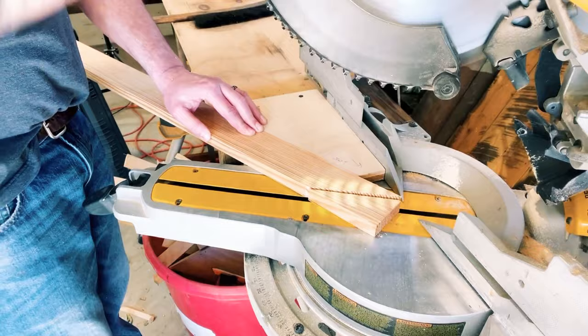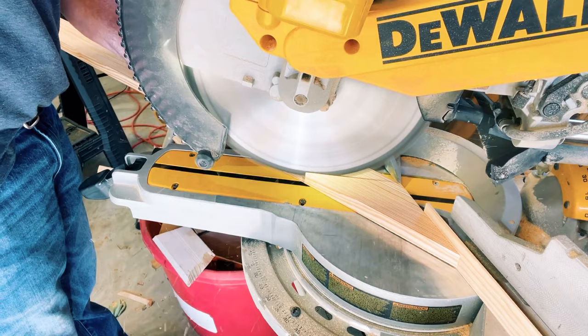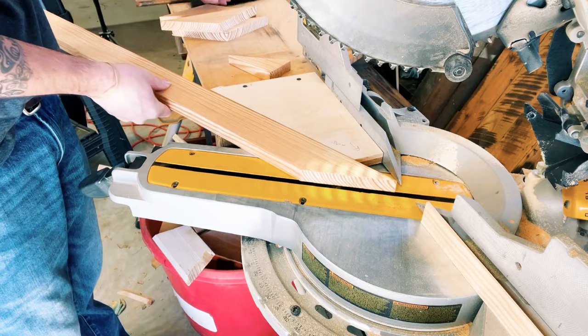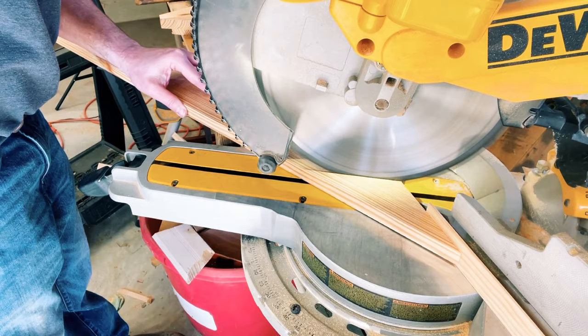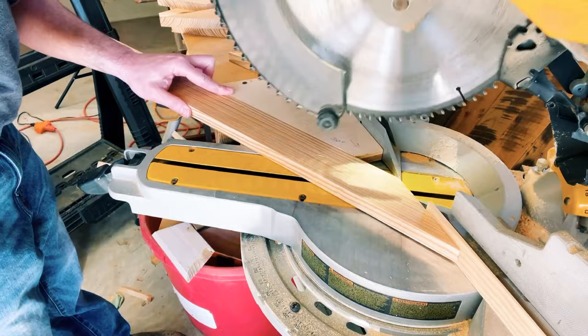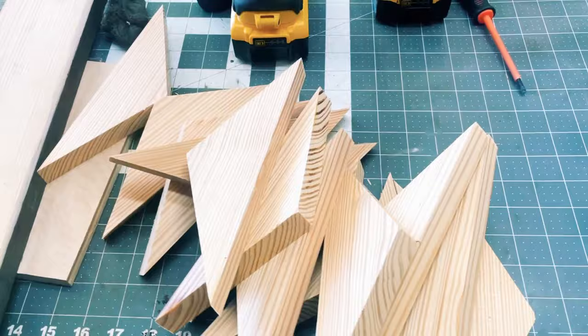We're starting out with just making our first cut to get the angle to begin with. All we have to do is flip this over and make that exact 60-degree angle cut again for a perfect triangle. I've put a board in the back up against the fence — that's just to help with spacing. That's not necessary, but very helpful. You could always just eyeball the triangle. What we're looking for is a sharp tip on the point. The spacer board helps to ensure that every single one of my cuts are identical. And as you can see, we have 12 triangles cut.